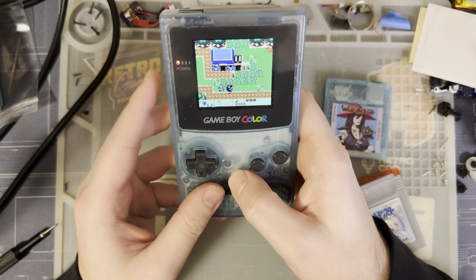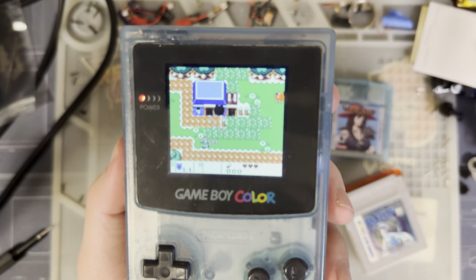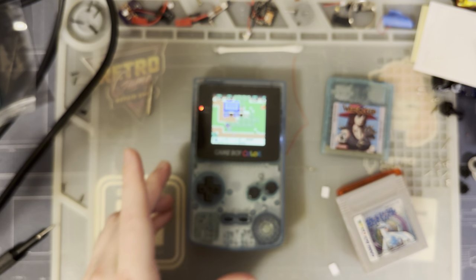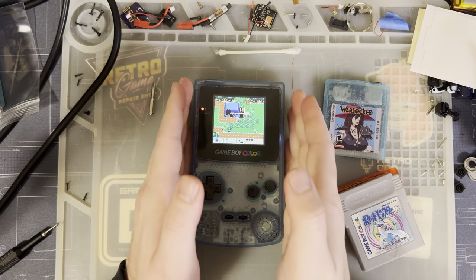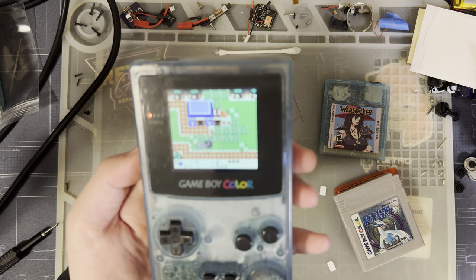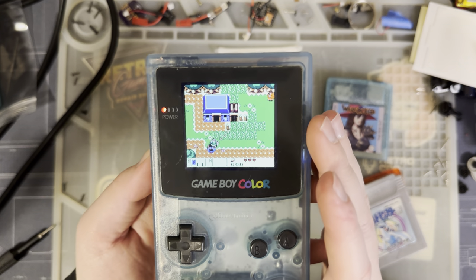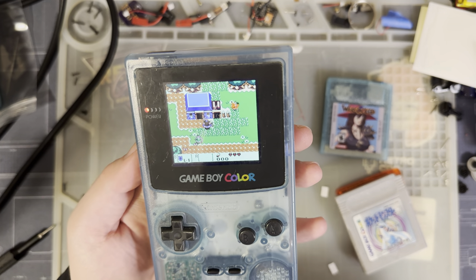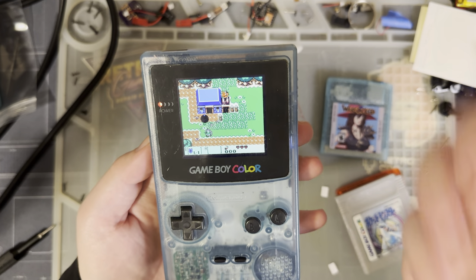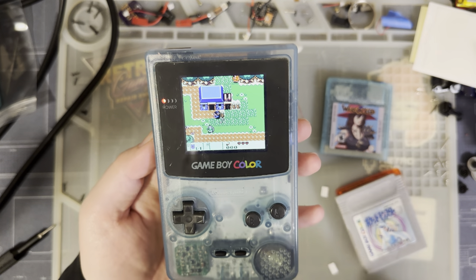Here is one of the usual tests I do with this sort of thing. The original Game Boy console had no method of achieving transparency. What devs did to work around that and get transparency is they would flicker a sprite on and off as quickly as possible — about 60 times a second, or 59.7. In this particular case there is also a sprite limit: the console can only display so many sprites before it runs out of memory.